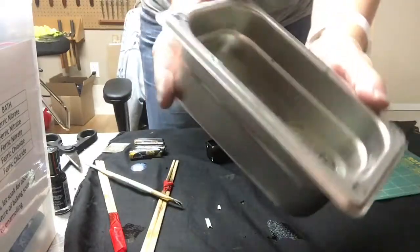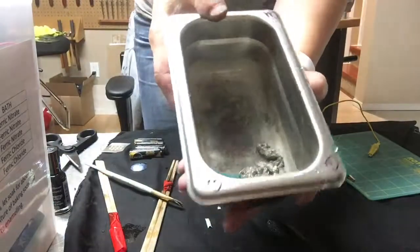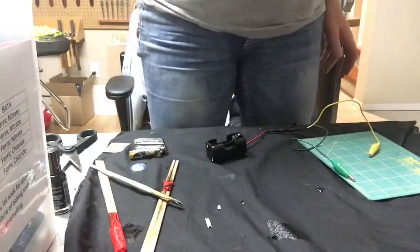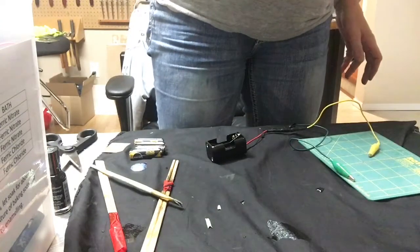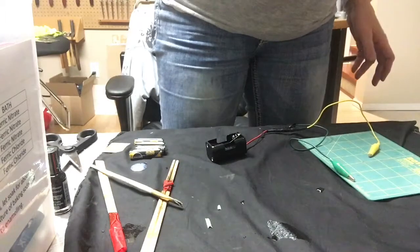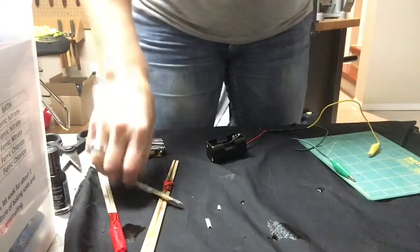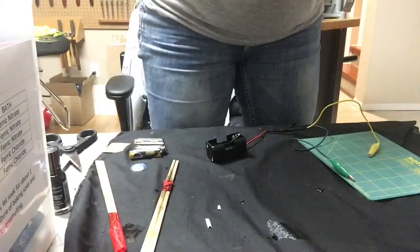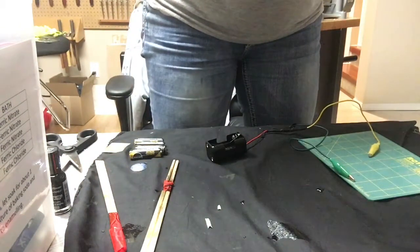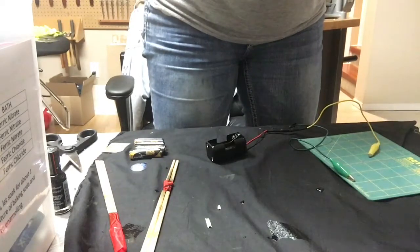That's really indicative of how much silver came out — all that slag at the bottom is silver, and the copper is that black stuff plated onto the pan. That's all going to go into the filter and I'm going to brush that out and save all of it because it is silver — fine silver at that.